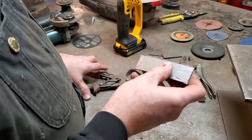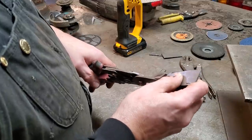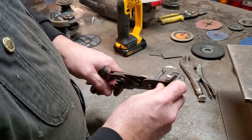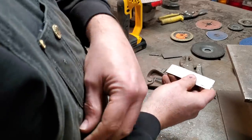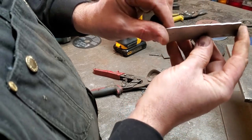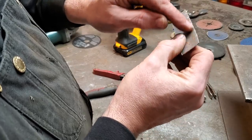Now, also, you see a lot of guys cut when they get into really hard, particular areas. They end up cutting sometimes like this. This is over-exaggerating. But you end up with this type of thing going on, where you end up with all these little divots. Now you've got the metal all distorted, and it's very hard to get that to go back out again.